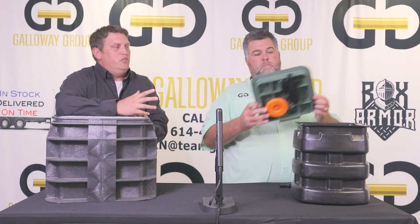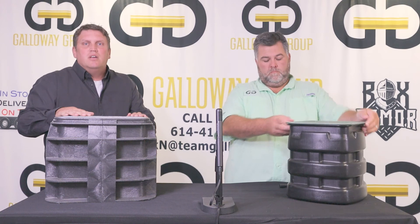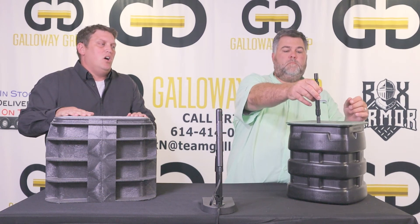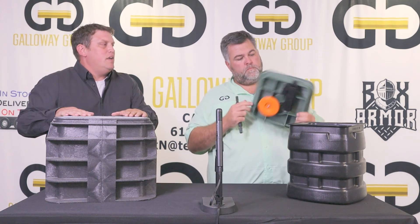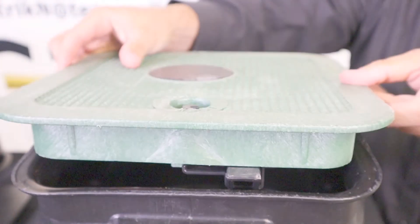Right here, what Eric has in front of him — this is our 1111 product that we've had for a while. We've added a new feature to it called our slam lock. It's kind of a utility box or drop box for the fiber-to-the-home stuff. We've had a lot of customers come to us and say their lids on their flower pots are getting picked up by lawn mowers or not getting put back on — they're having to buy new lawn mower blades for customers. So we designed the new slam lock that allows the technician to go in there. They can put it on any way because the box is square, all they have to do is step on it and it's locked. Then it's just a standard can wrench 7/16 to open it back up.